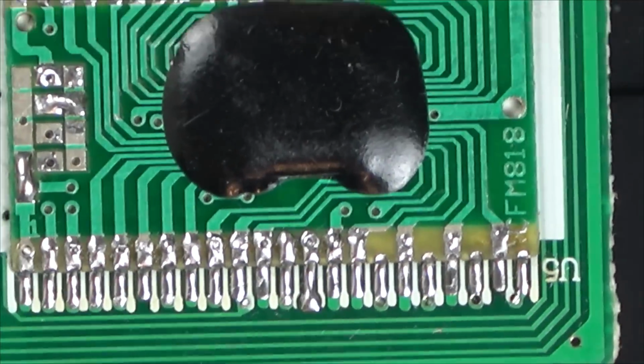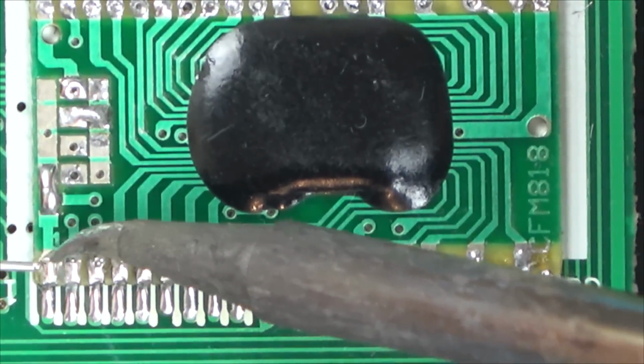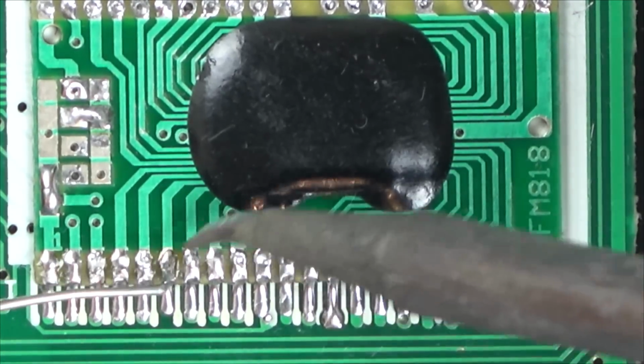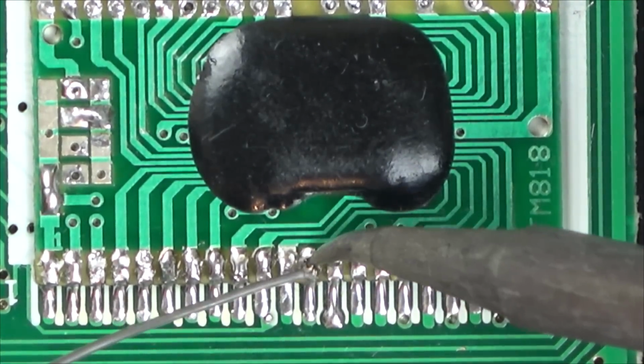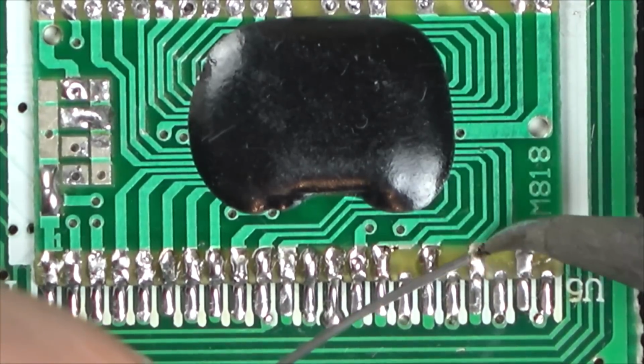If you see me use 0.1mm wires in other videos, I'm thinking the bond wires are probably going to be 1/100th of the size of that. And I don't even think they're soldered. I think they're too small for that. They're ultrasonically bonded or something like that. I've been told about it before, but unless you're dealing with it all the time, it slips your mind again. But the problem here could be caused by not the actual chip itself.